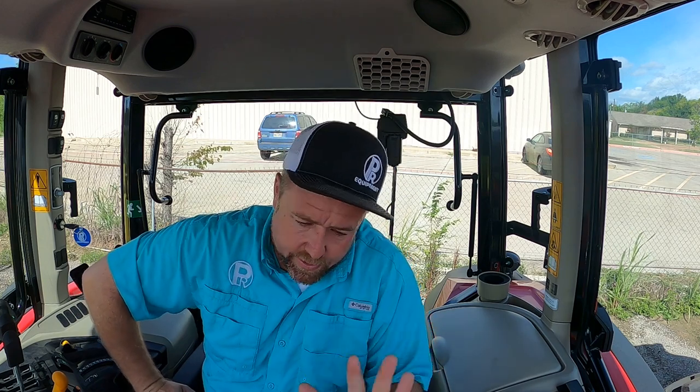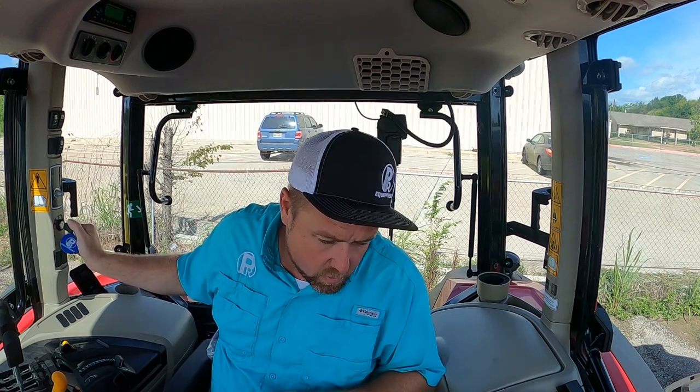Keeping in mind, I had to go very, very slowly. I'm not very good at doing things slowly, but I had to. So it's a good little learning experience. You guys got to see what one looks like that failed, and we're going to do one that works. And so now our clutch is going to be adjusted. Oh, park brake has to be off for that procedure. I should have mentioned that earlier. Make sure your park brake is down.